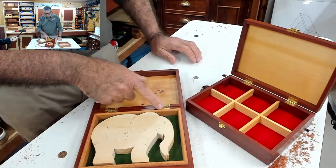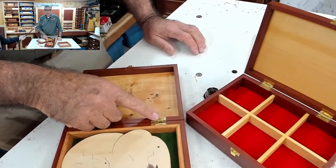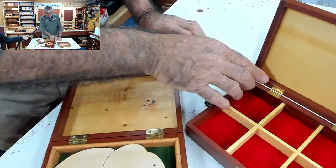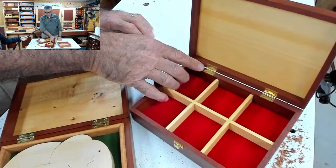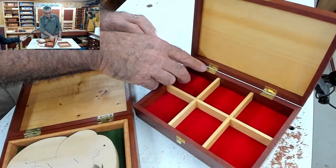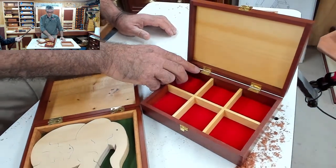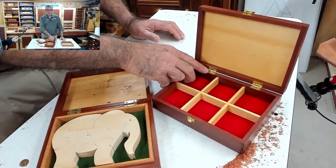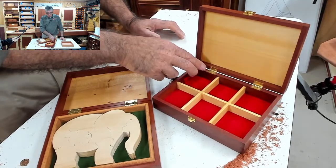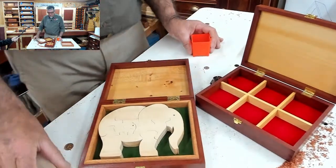Now, these hinges here are relatively inexpensive Chinese versions. And they're 1-inch, not 25 mil, 1-inch. This one here is a reasonably good quality. This is a Gerner hinge from Anton Gerner's stable down in Melbourne. Very good quality. Actually, I beg your pardon, it's not a Gerner hinge. This one here is a Brusso hinge from the US. And the US use not 19 mil but 3/4 hinges. So a good quality hinge, it's a stop hinge. The Gerner hinge is what I'm going to be using for our box.